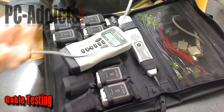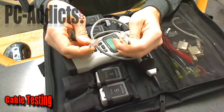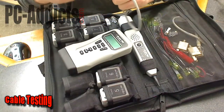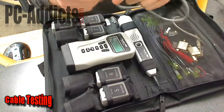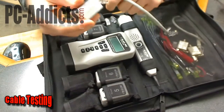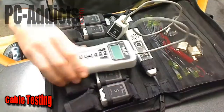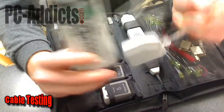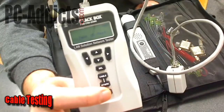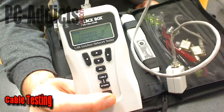This is a cable that was made by someone in the shop at some point — RJ45 Cat5e network cable. Let's test this cable and see if it's good — see if all our ends are seated down on the pins, making good contact, and also if they're in the correct order. This is important when you're making your own cables. If you don't have a cable tester, I don't recommend making cables because you won't know if it's good, bad, or intermittently failing. I've got it plugged in, let's turn it on. It says 'pass' — cable is three feet long. It reads how long the cable is and shows all pins are good.